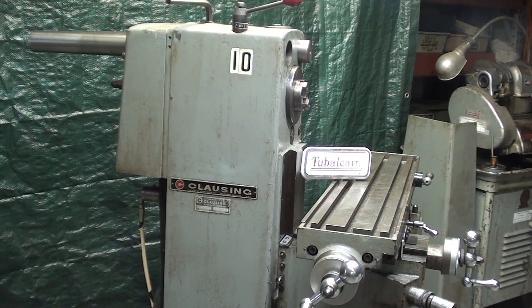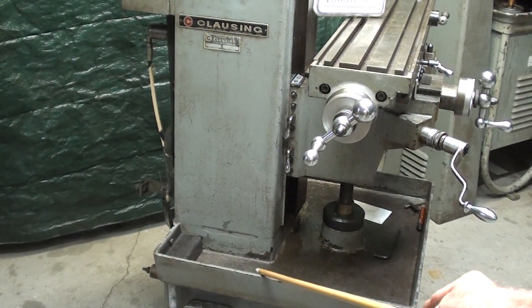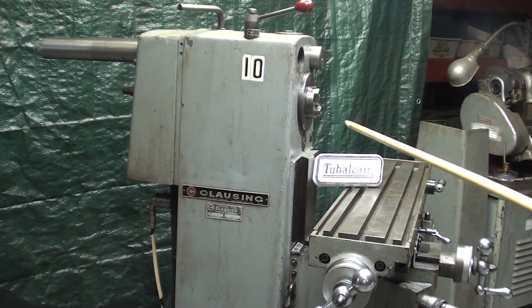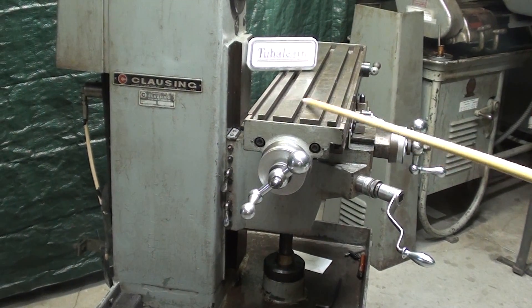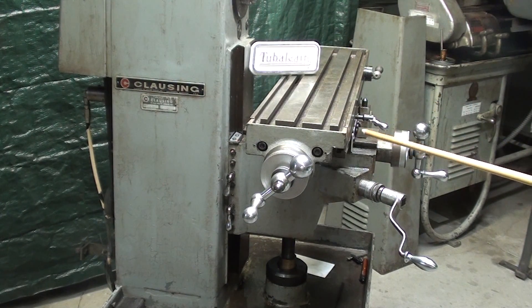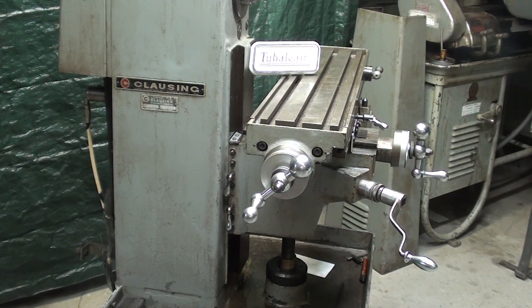Now here are the main parts of the milling machine. Some of this was covered in the other videos, but down here we have the base, and that's a chip pan there as well. This is the column — the column supports all of the other parts basically, and includes the spindle and the overarms here. But more specifically we have the table, the saddle — which is rather hidden here but is talked about in the other videos — and this is the knee. Sometimes these milling machines were called knee milling machines. Visualize yourself standing against a wall and raising your leg with your knee sticking out — I think that's where the name was derived.